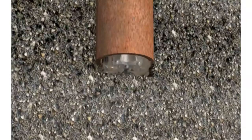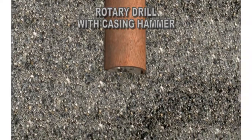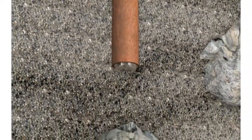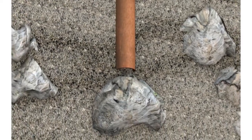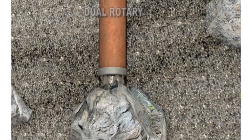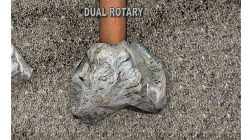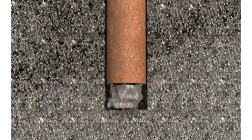Casing hammers are noisy. In comparison to other drilling methods, their effectiveness decreases as depth increases. The percussive force can damage the casing and possibly break a weld. In addition, when a casing hammer encounters a suspended boulder, its progress may be halted, and continued efforts to crack the boulder may result in damage to the casing or borehole deviation. The Foremost DR, with its rotating carbide shoe, can cut and set casing right through the boulder.